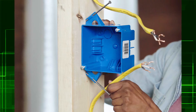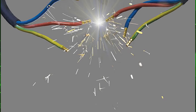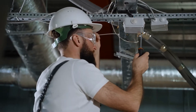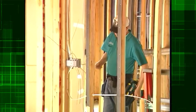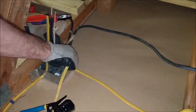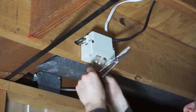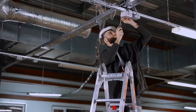Making connections outside the electrical box. Junction boxes are used to protect connections from any accidental damage that may occur. They may also contain sparks and heat as a result of a faulty connection or short circuit. To ensure that wires are properly protected, they should always be connected to the electrical box. If you notice a connection that is not made in an electrical box, install a box and reconnect the wires inside. There are online tutorials available to assist at-home do-it-yourselfers with this task, or you may want to hire an electrician.